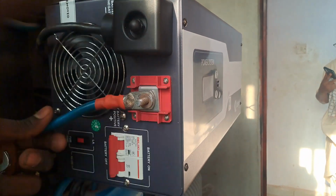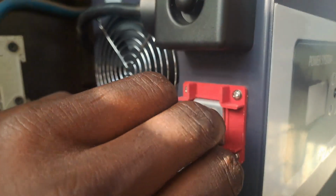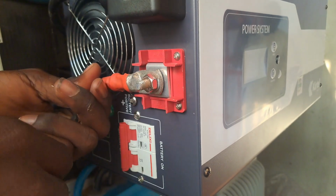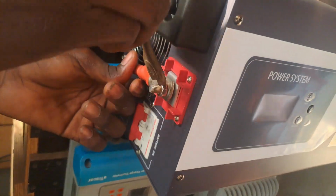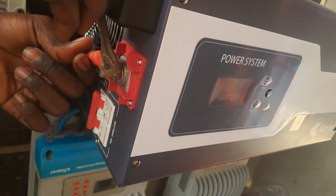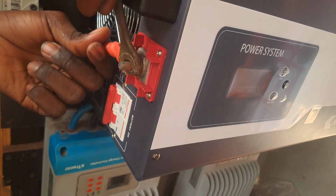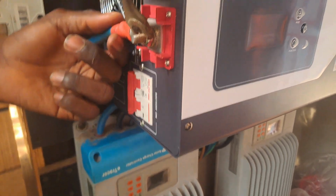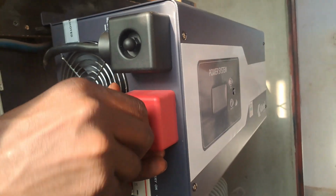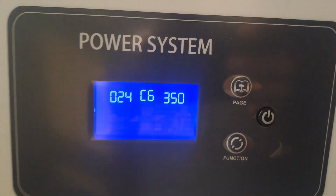When you look at what is happening here, you can easily denote that the positive wire can be either red or blue. Most of the time, people ask which color is best for this, but following the right color coding, whenever you are using blue in place of red, which is the positive, you have to use red sellotape to indicate it. Why does it need such professional indication? Because perhaps you may not be the one to come for the maintenance. Because you used the right color coding for the cable, you help the person maintaining the system to easily find out whenever there is a fault, troubleshoot and indicate.